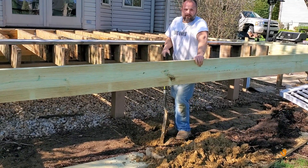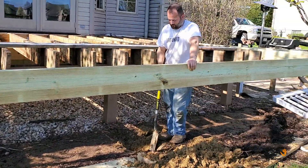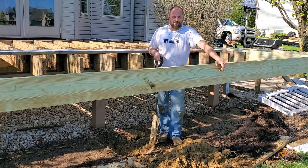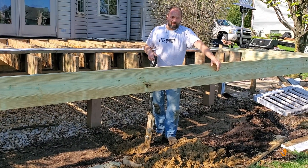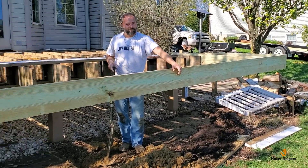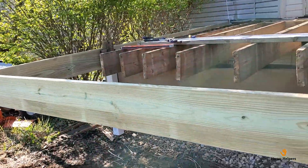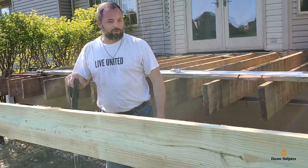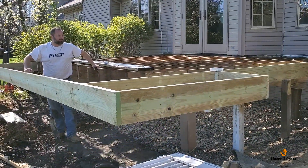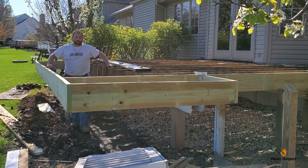What are you doing right now, Jason? Digging the holes for the new posts that are going to carry the extension — got one dug, started on the second, one more to go. How deep are they? 36 inches to get below the frost line. And you're doing it all just with a shovel? Wow. We've got the deck all stripped off, the new perimeter boards kind of set so we can start adding floor joists, the extension built for the grill, and the post stripped for the stairs — ready for new stringers and new steps.